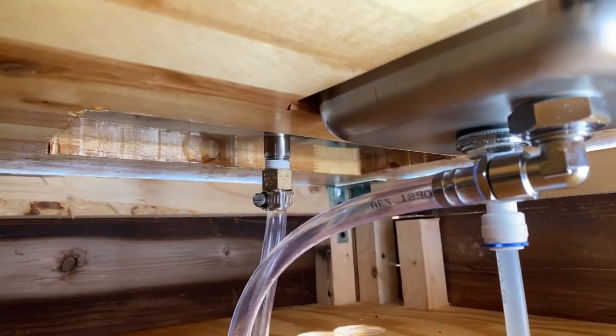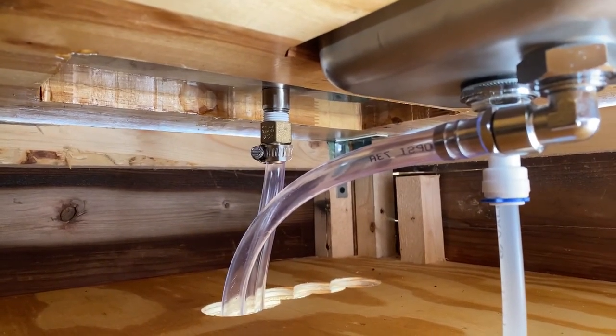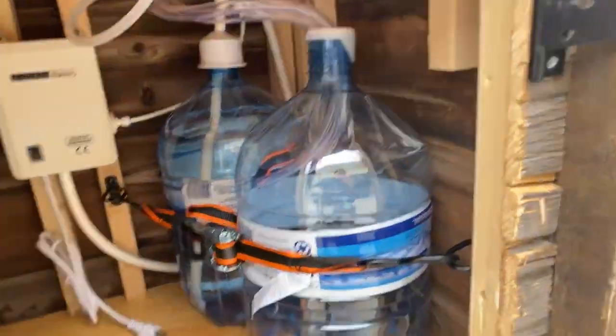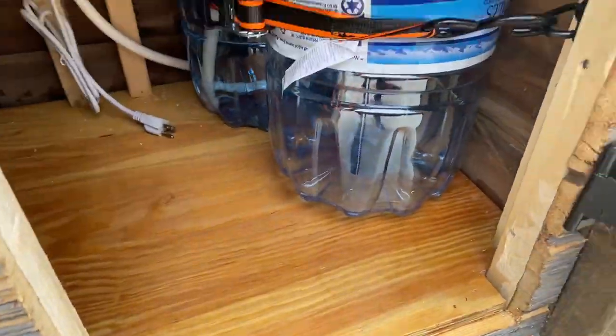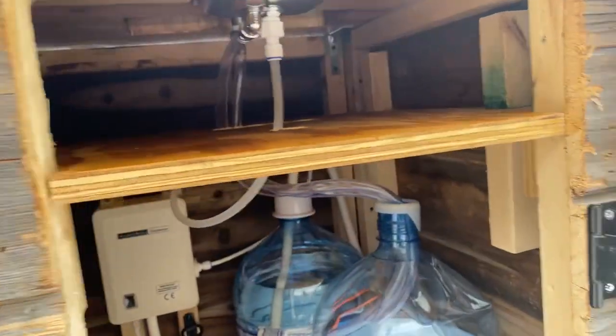You can see the attachments down at the bottom — make sure you have those clamps at the very bottom to hold the hoses on so they don't come loose. Also, when you are doing anything with water, make sure you are sealing everything. I did seal this bottom, this top, and also the top of here — that's why you see this gloss shine. That's very, very important.